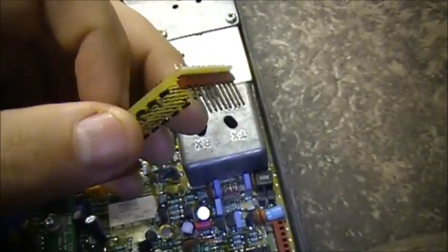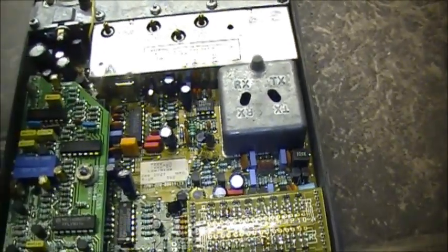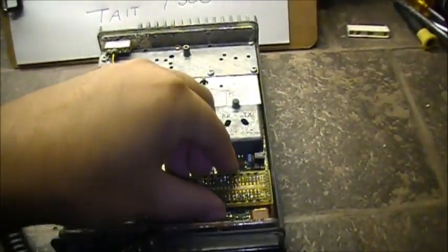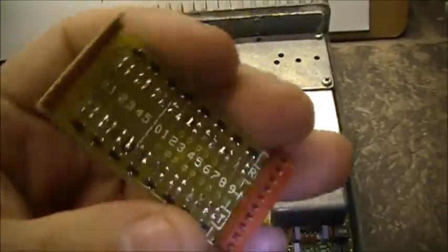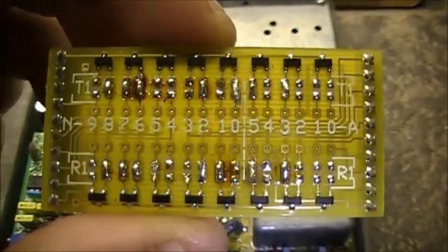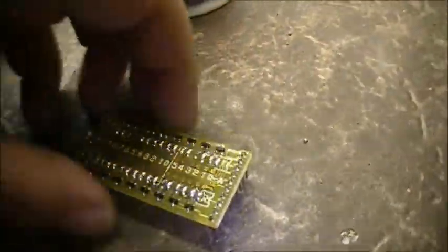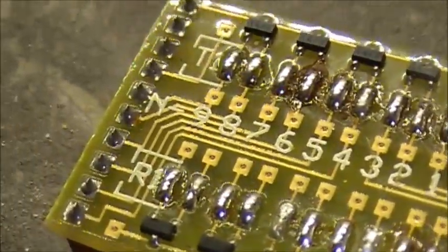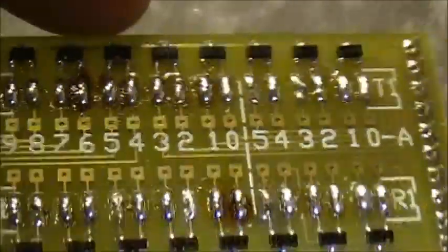You just take your little board here and plug it in. Then you have to go through the alignment and everything else, which is fun — I haven't gotten to that part yet. But just for the programming part of it, we will prepare the board for programming by shorting all these connections. Right now all these solder joints and jumpers are closed. This is normally how you would set your board up to begin with — normally these would all have to be closed. That's the first part of programming your diode matrix board for this particular Marconi Canada, which is really a Tate T500.